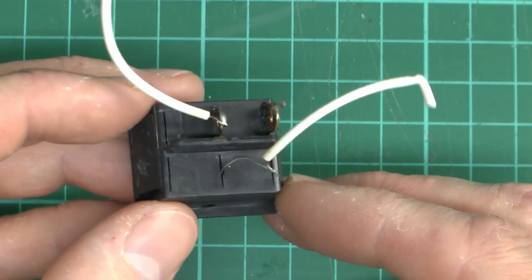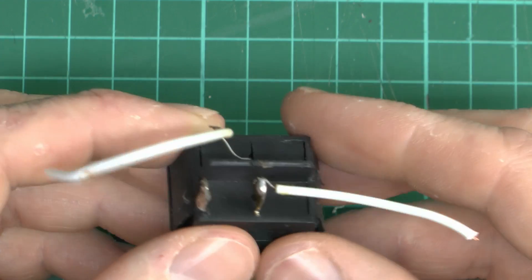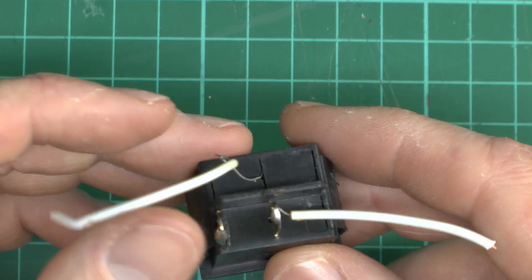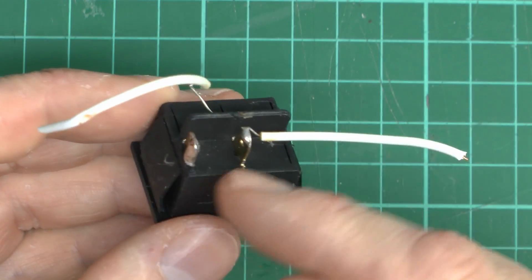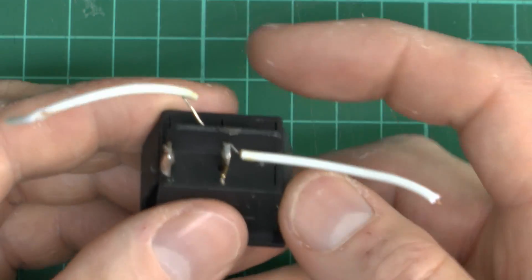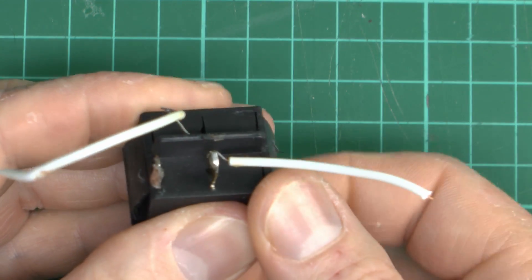On the top here we've got the various wires, one of which literally just ripped off — I did attempt to solder there but it proved to be next to impossible. What we've got here is basically a single-pole switch, so these are the switch contacts here, and that's where one of them busted off. This over here is a neutral connection for whatever indicator is contained inside — so it's line in, line out, and neutral so the thing illuminates. Now if you actually move the switch and watch that wire, you'll see that as the switch moves, so does the wire on the back — a pretty poor quality item.